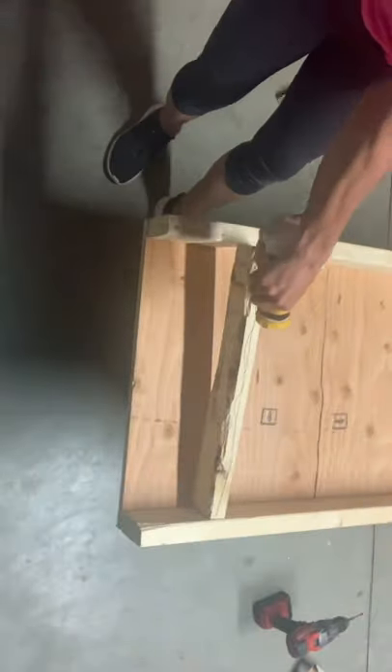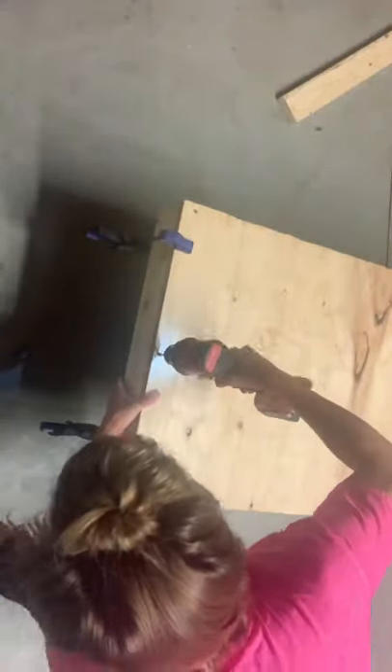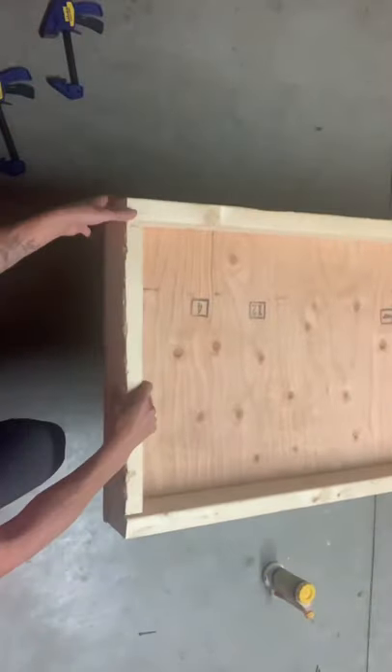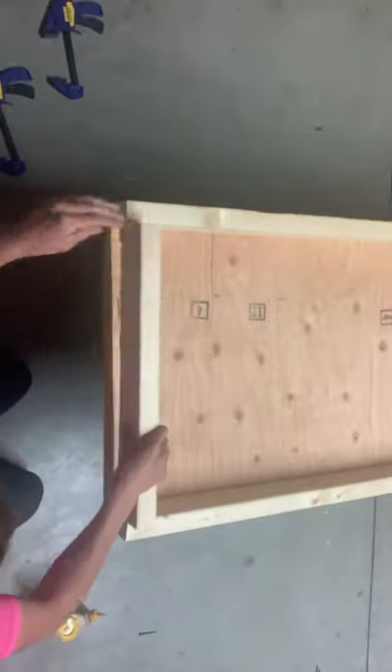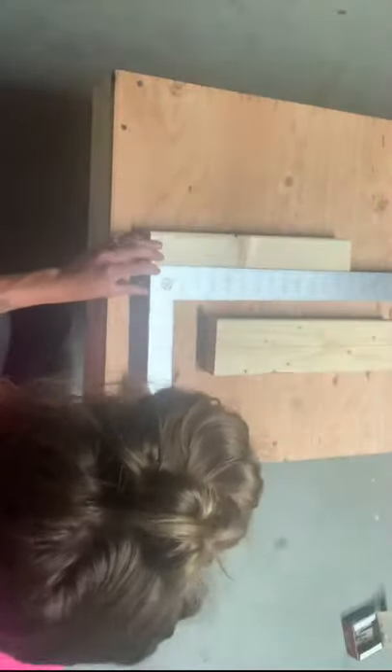I used about five screws on each side. Then I took my shorter pieces measuring 21 inches long and secured one on the top. You can find these wood clamps right at Home Depot or Lowe's. I secured those two pieces together with my handheld drill and screws. I flipped it back over and took my second 21-inch piece of wood and some wood glue and put it at the other end of the board. So now I've taken the 24-by-48-inch plywood panel and framed it in using the two 48-inch pieces on both sides and the 21-inch pieces on the top and bottom. I took my 12-inch pieces — two of them — and made a mark down the center of each piece.